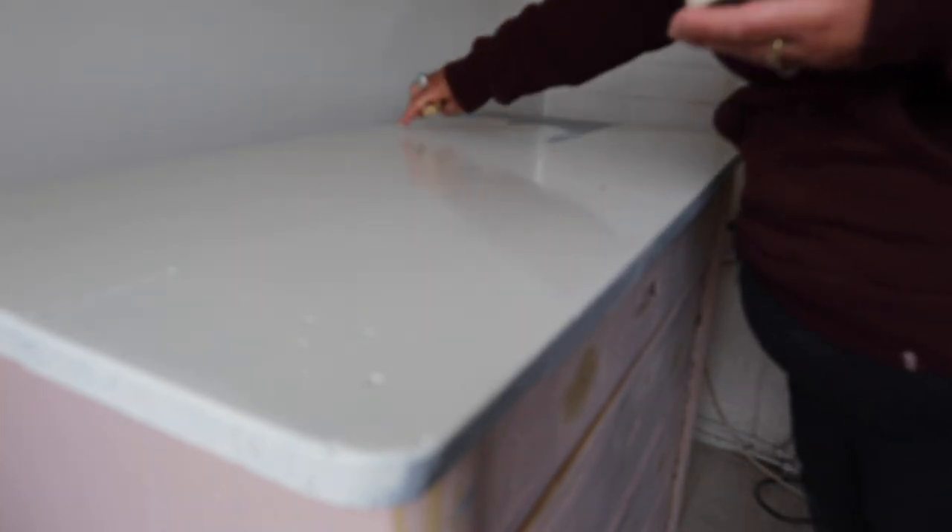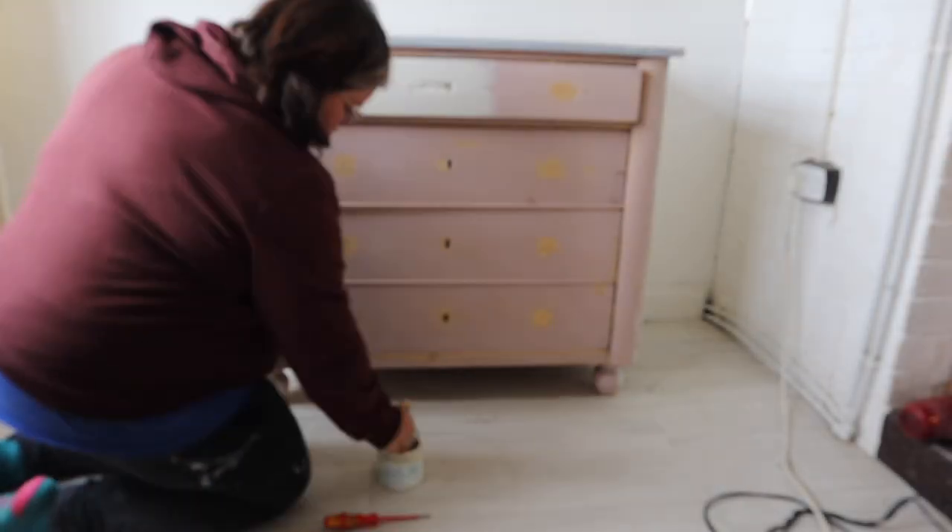I'm starting with the top first and as you can see I'm using relatively long strokes. There are lots and lots of blemishes on this top so I'm working the paint into those. The last thing I do when I finish my application of Silk is just to really lightly run the paintbrush over the surface before I move on to the next area. I've slowed the camera down a little bit so you can see — I'm just really lightly laying off that paint, and this gives you that really smooth finish I'm looking for.